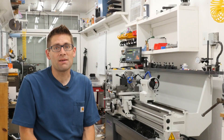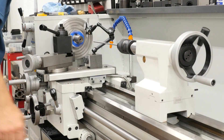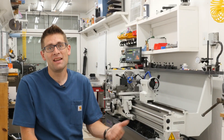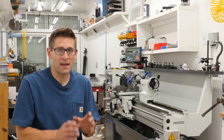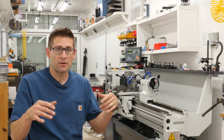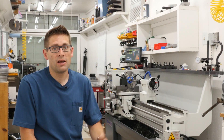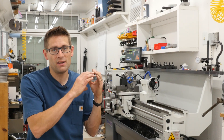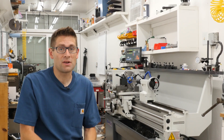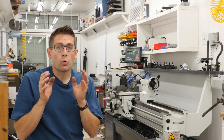It's here, it's amazing, and I've totally gotten used to the lathe. It sounds good, runs good, does really great work. One of the projects I've already done that I'll make a full video and blog post on is the lathe spider that holds long rods on the outboard end to help true in rifle barrels. I found a way to design a pinch clamp so you can install and uninstall the spider without taking off the side cover — pretty cool, you can leave everything set up on top of the machine.